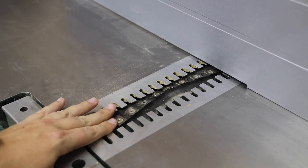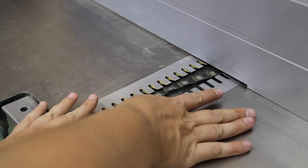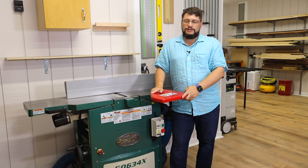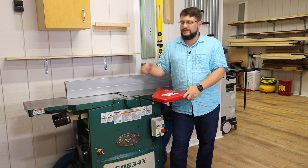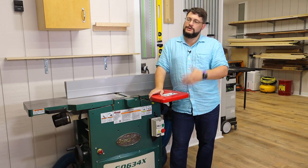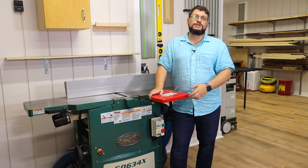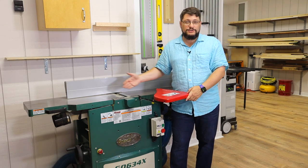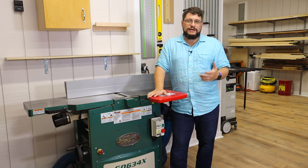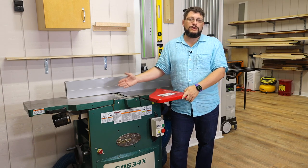It's got a V-shaped helical cutter head, far superior to any straight knife machine I've ever had before. It stays sharper longer and it's really easy to switch the inserts around. It's been 18 months — I'm not using it every day, but I've been building projects here and you probably won't have to change out these inserts in the first year, maybe in the second or third.